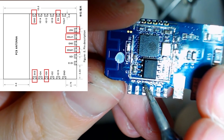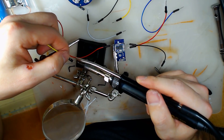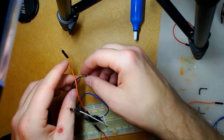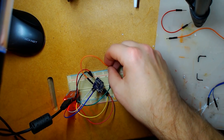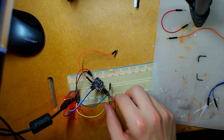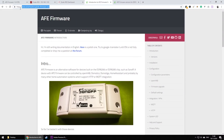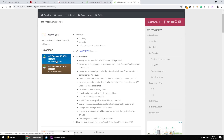A couple of minutes later, I was able to add some wires to the ESP device and connect it to my serial programmer. From now on, it's pretty much straight up following my Sonoff tutorial. First, I'll strongly recommend you to make a backup, because if for some reason you want to revert to the original software, obviously this is how you're going to restore your firmware. So make a backup first, and here's the link for you to follow. Once you do that, just download the AFE firmware from this website. Make sure you're downloading the ESP8266 version, and you'll be able to flash it onto your board.